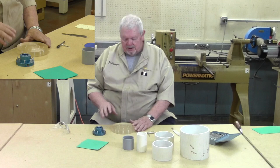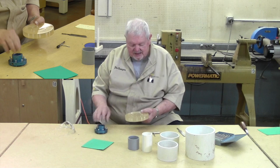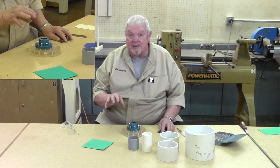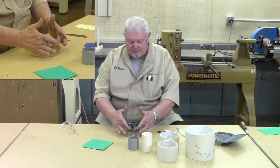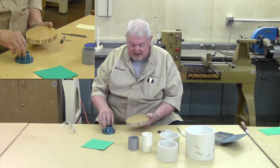First of all, I'm going to use a commercial faceplate. I'm going to find a piece of acrylic of the right size. I roughly turned this. I drilled and tapped these holes. This happens to be 8-32 thread. And when I screw this on into these tapped holes, I'm going to have a very tight, vacuum tight seal at each of those holes. I'm still going to put a bead of caulk around here. Screw that on. But I screw it onto the side that still has the paper, because the paper is like a small seal. So I'm going to screw this on here.